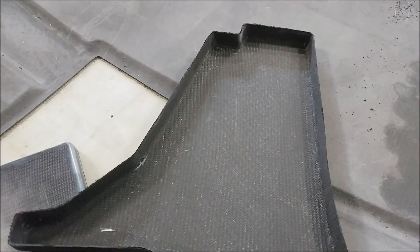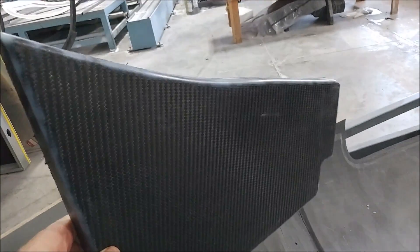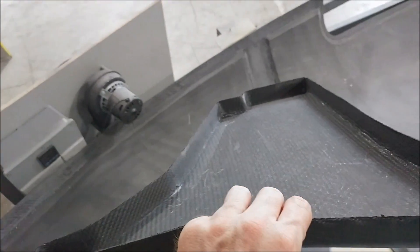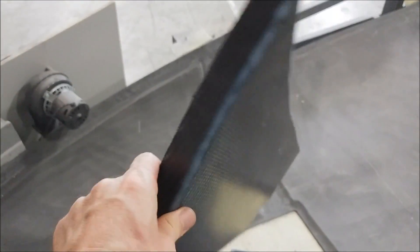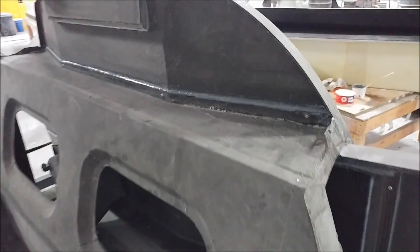Here are the glare shield brackets — they've been released and had their flanges trimmed off, so they're basically ready to go. Having a bunch of parts ready means that as the fuselage comes together we can just bond things in rather than laying up. And here's the aft pressure bulkhead — it's now been bonded in.